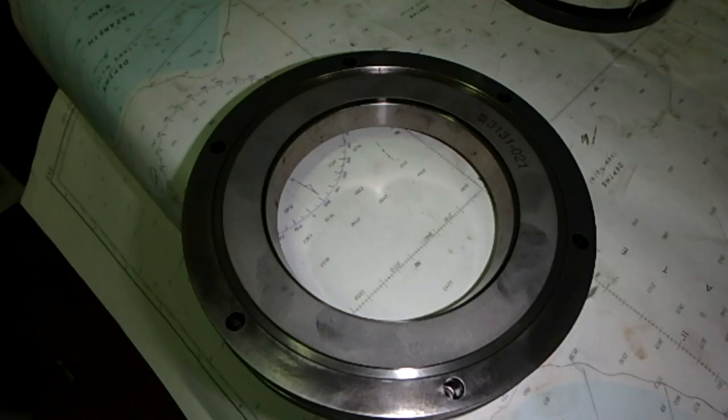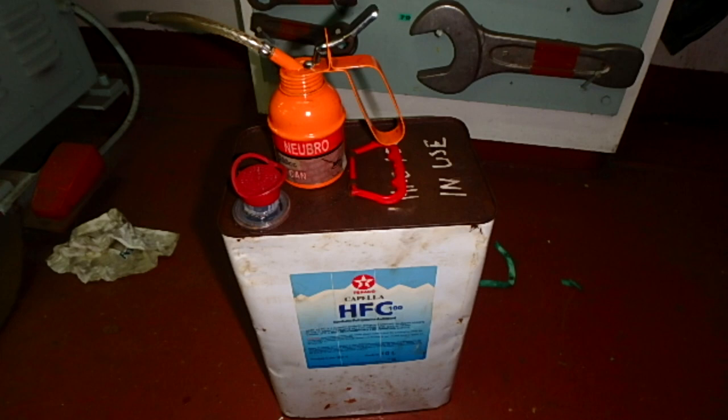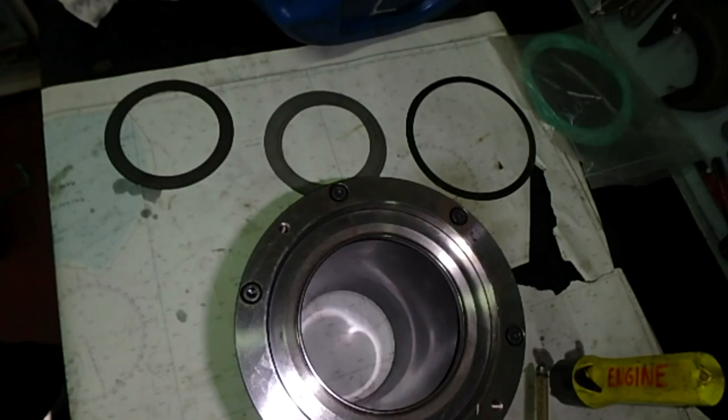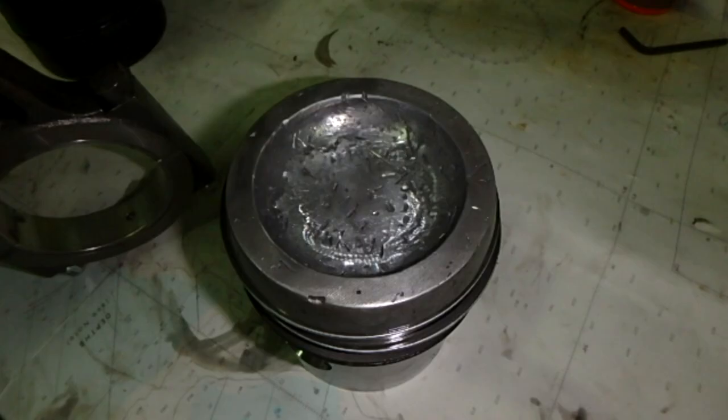What we will do next, we will assemble all the parts. We'll place them in the same place. Everything will be checked, everything will be tested. Only appropriate oil will be filled next. But before the filling of oil, let's say we have placed all the parts inside. We have tied everything properly, we have checked everything, all the mechanical seals that we have placed, replaced all the filters.